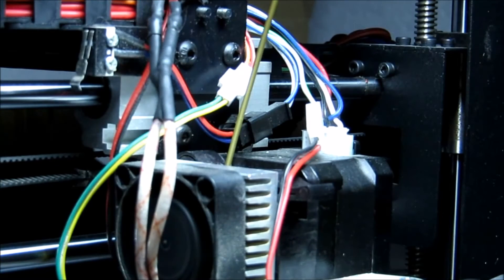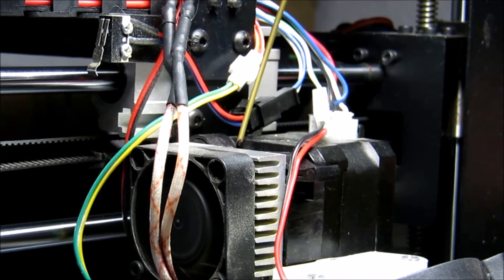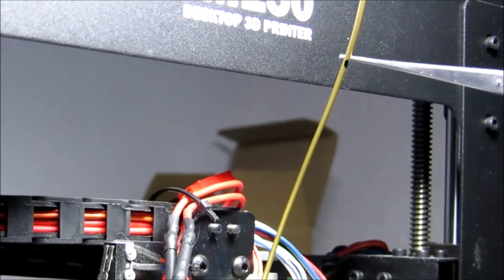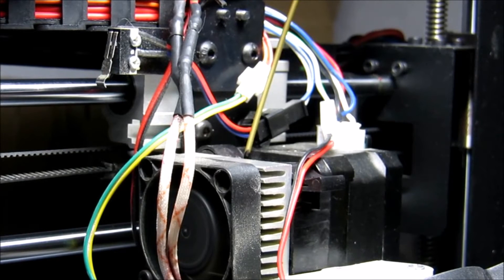What I'm going to do is put a mark on the filament and then another mark a hundred millimeters up, then feed it a hundred millimeters using the settings in the prepare menu and see where we go. We can see I've made one mark just above the lever here for the extruder, and if we rotate up the filament we can see the mark for 10 centimeters or 100 millimeters.